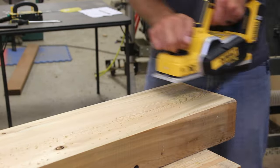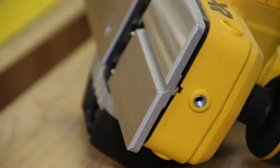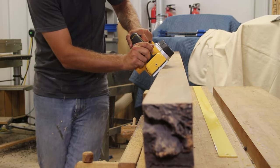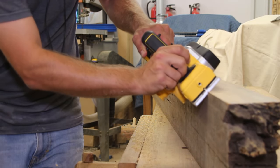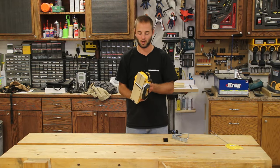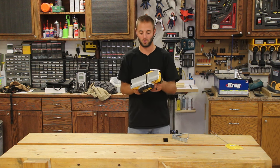On the front of the shoe there is the same precision-milled aluminum and a V-notch for applying chamfers to boards. One thing to note: the settings are exaggerated in the V-groove, so a 1/16-inch cut there will actually produce a significantly larger chamfer. I highly recommend doing a test cut before chamfering and starting on the lowest setting, then working your way up.